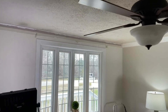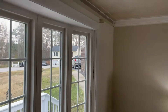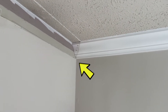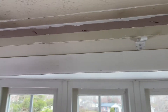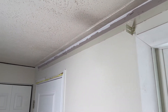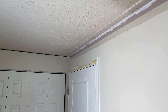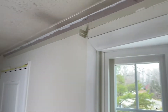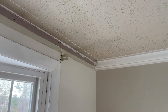When you measure that first wall, put the tape measure all the way to the wall because you're measuring for the 45 and you want to know the full length. Put the tape measure just below the crown right there on the drywall and then measure from corner to corner. This length here is 15 feet and we have 16-foot pieces, so when we cut the right side we're going to cut it as if it's a 45 inside corner and then I'll show you how to cope that crown.